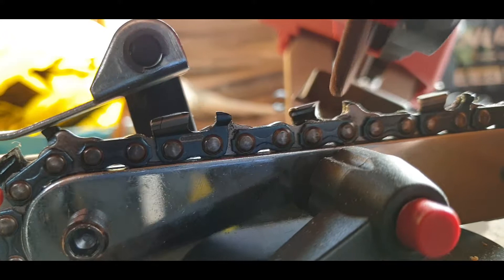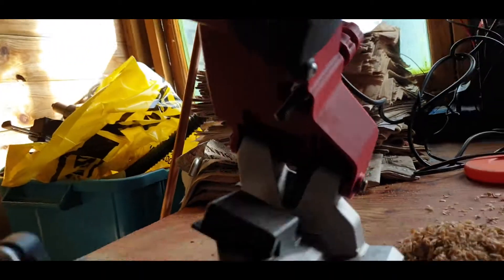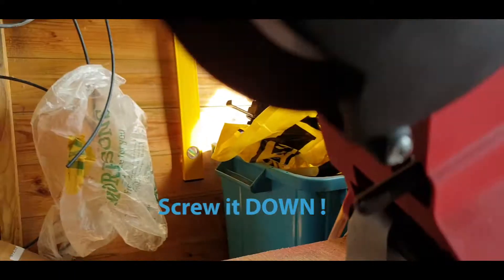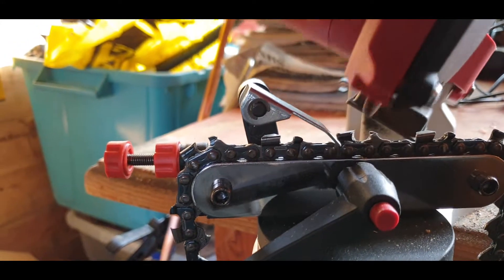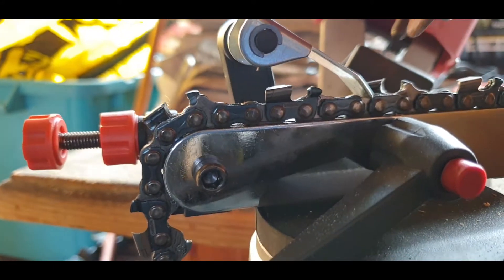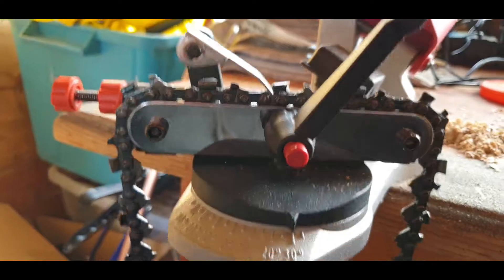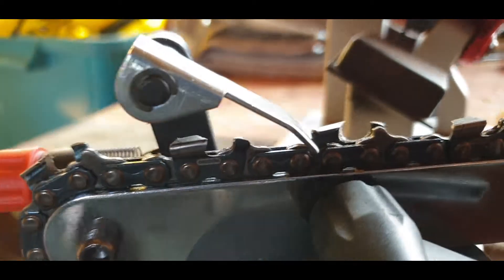The first thing we want to do is the height. As you can see, that's not touching anything there. Screw this out — that will lower the cutter. Now it's gone too far; we are actually touching. So the best thing to do is screw that out till you see it lift off. I just moved this up and down, so it was coming into what could have been contact. As I tighten this up, I'm going to put a little bit more tension on here. You can hear that — it's just engaging now. That's us; I held that in place while I put some tension on. That is now firmly held in place.